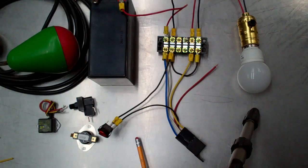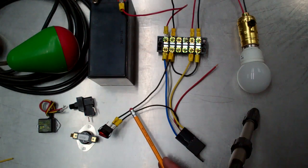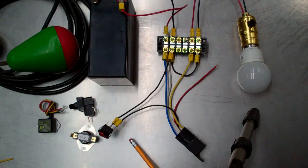Essentially what a relay is is a switch that switches a switch. One of the reasons for using relays is to be able to have the switch some distance remote from the load, because the amount of current used to actuate the coil in the relay is very low. We could have this switch a hundred feet away and it would operate the relay without any trouble with the right size small wire.